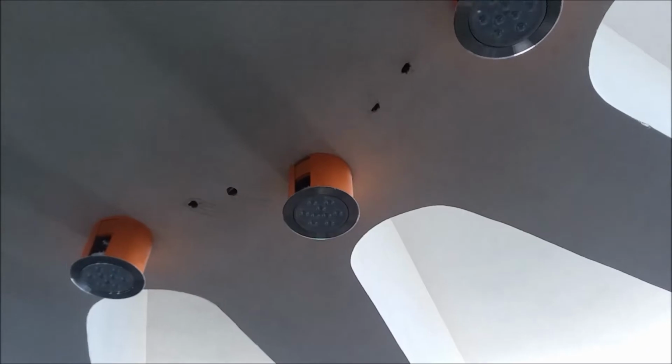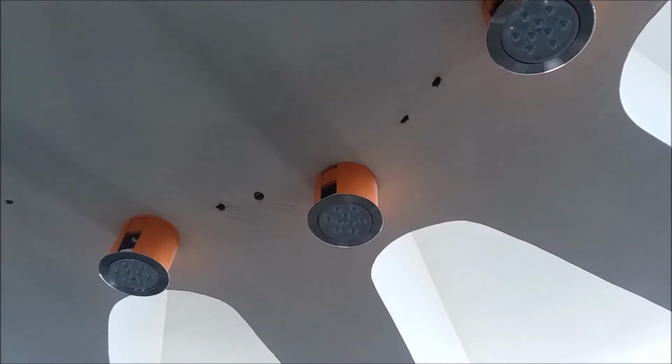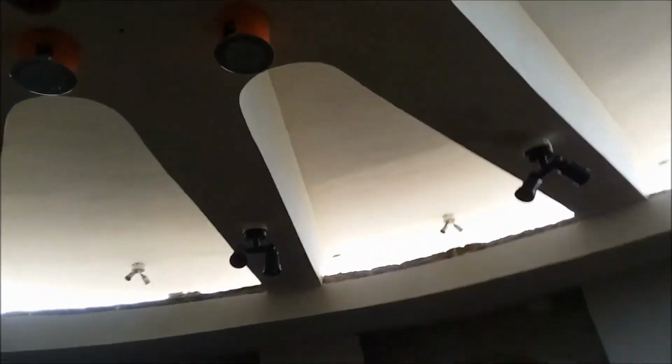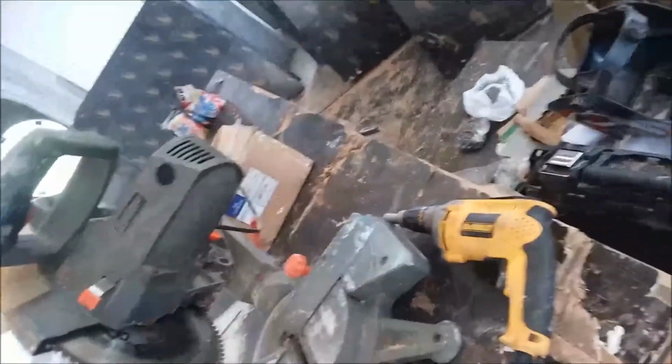Yeah, see in between those can lights? There'll be threaded rods up. Concrete's 31 inches thick right here, and the rods go right out the top. And then above that is where the wind turbine goes, on the other end of the same bolt.